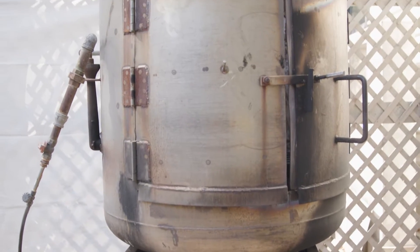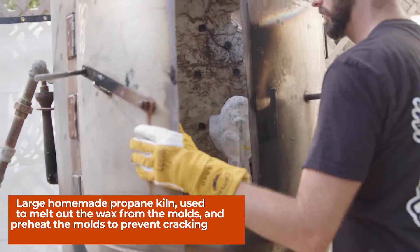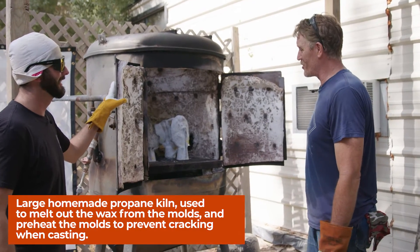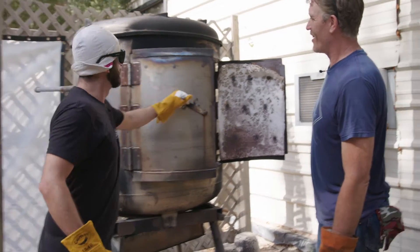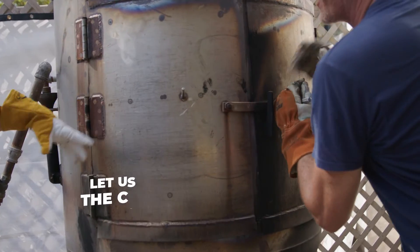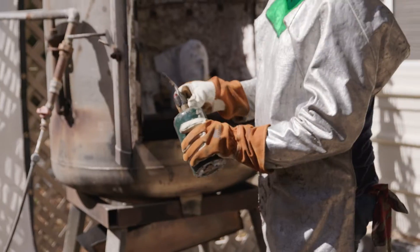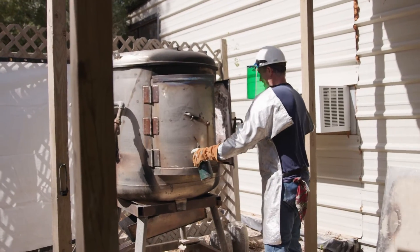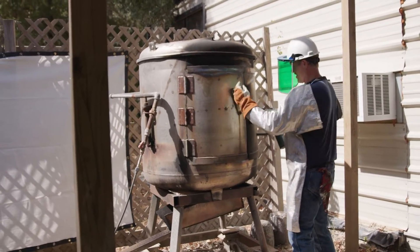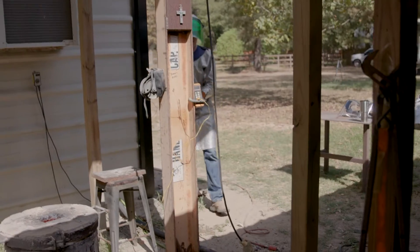While we're turning those big old bricks into molten metal, Lori told me they build a lot of their own equipment here. This is a homemade kiln — they found it at a scrap yard, cut a big hole in it, put doors on it, connected it to propane, and built a little frame under it. They use it for burning the wax out of the ceramic shells. And Lori also mentioned you can't pour hot metal into a cold mold, so everything has to be preheated.